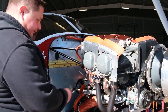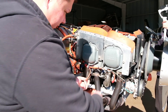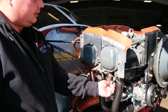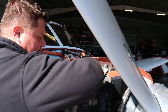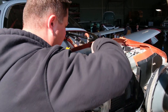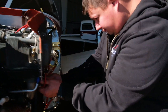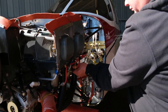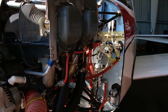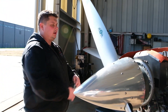Since we secured inside, we're gonna make sure we got all the spark plug leads disconnected. That way we're making sure even in case it sparks, it's not gonna start the engine. With all the spark plug leads disconnected, we can easily turn the prop without starting the engine.